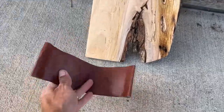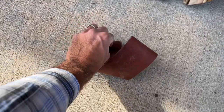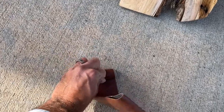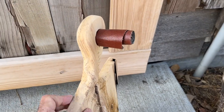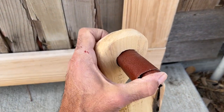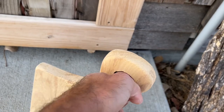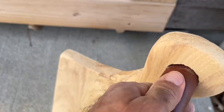Use a basic sleeve for a belt sander. Just roll this — I'm going to try to do this with one hand as I film here — but you want to roll that and sort of predict how tight this is going to need to be. That's my right diameter. And so what I can do is just work this around and just kind of sand that inside circle to give me a nice smooth edge on the inside.